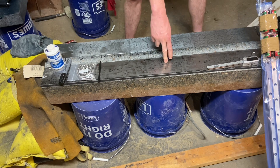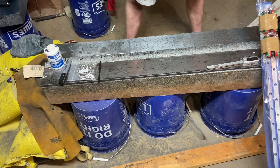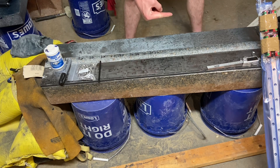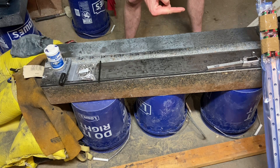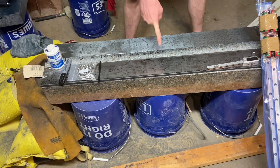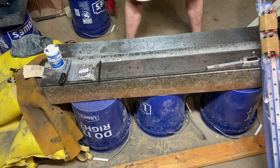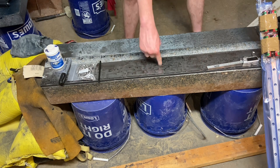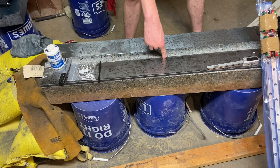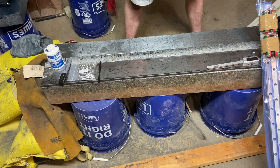The reason I'm doing that — having them kind of off-center — is that even though my spindle is going to be in the middle, I don't really see myself needing to have my cutting tool passing the axis of rotation very often. I would assume that the vast majority of the work I'd want to be at the midline or further back. By doing this I'm minimizing the cantilever distance of the cross slide plate, and I want this linear rail moved over to minimize the simply supported section distance.